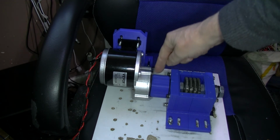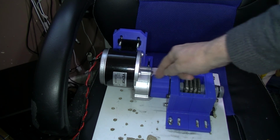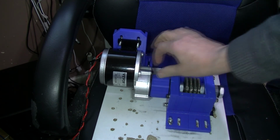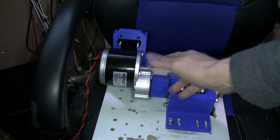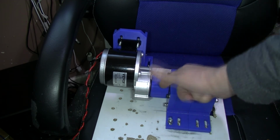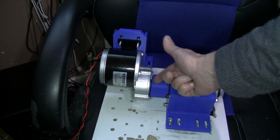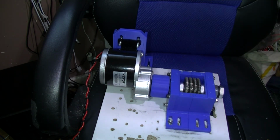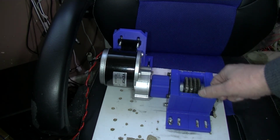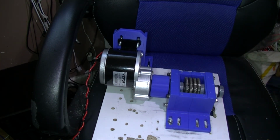I am a little bit worried about the sprocket in here that will wear out the plastic. This sprocket has a keyway in it and it has a bit of a ledge on it, and it is possible, I reckon, to remove that sprocket and just put two sprockets the same size but with no ledge on. By putting two sprockets in there, it's going to double the width of the teeth touching the plastic, and that will help grip and stop any wear. That's one thing that concerns me, is the wear of that sprocket in there. As I say, it's only a single one on that, especially when we start cutting plastic over any length of time.